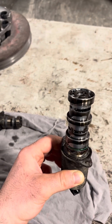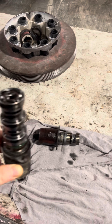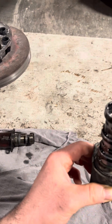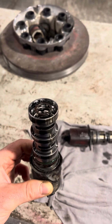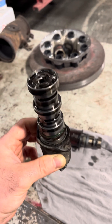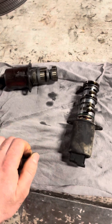On the MP8 — the newer ones anyway, the truck I'm working on is a 2013 — the piston cooling jet solenoid is actually set to the left rear. On the MP7 it's on the right front, which makes sense. On the MP8 it's towards the back of the filter pad, on the left if you're looking from the passenger side. It's very easy to get to, especially on a standard, but on an automatic you've got the cooling pipes in the way.